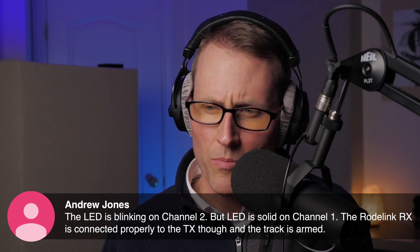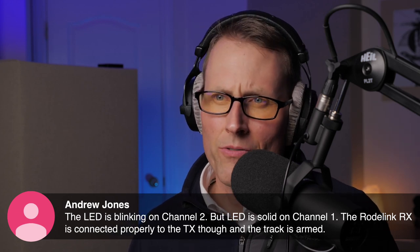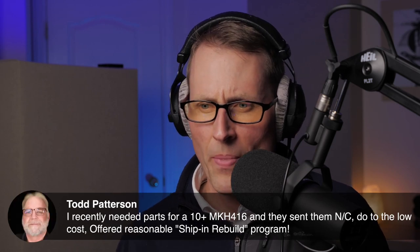Rode link is connected properly to the TX and the track is armed. Yeah, that's about all I've got for you. If you have any other information, let us know. But that would be the first thing I'd check, is make sure you're on mic level, not line level.